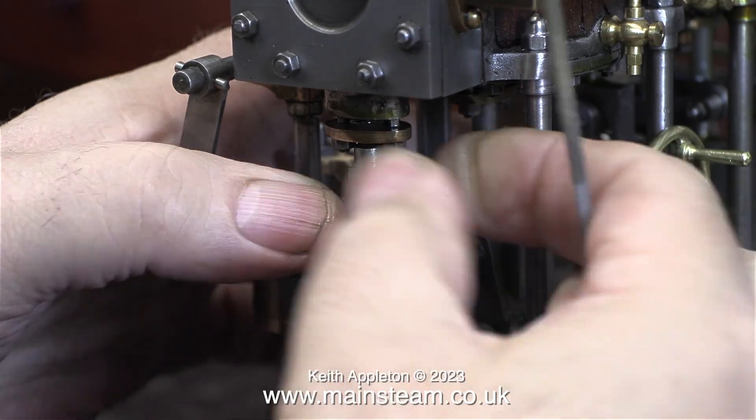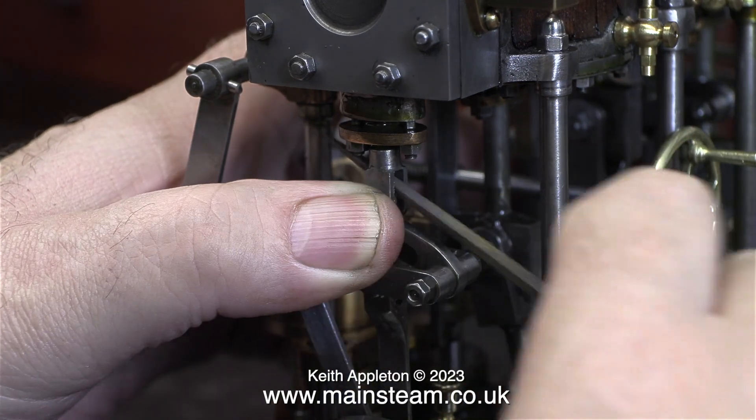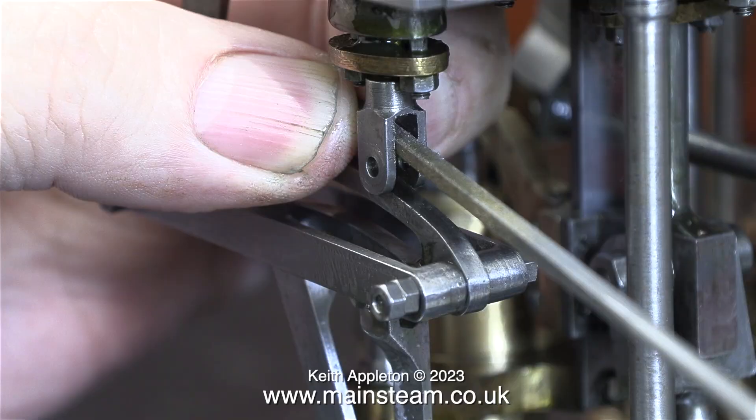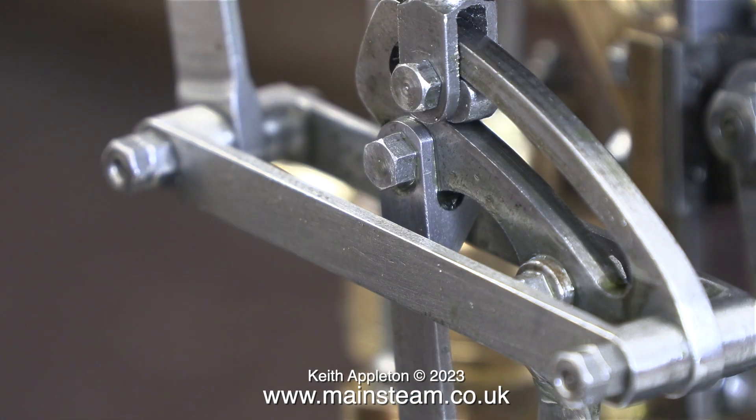In this clip I'm filing the edges of the valve fork, but more importantly have a look at the end of the drop arm — you will see a long taper pin in there. The taper pin used in the operating arm, which is bigger, holds it much more rigidly than it did previously, as there was quite a bit of movement between the drop arms. Now there isn't — the entire thing works as one unit.